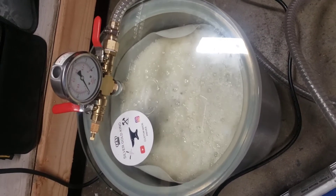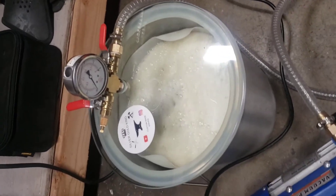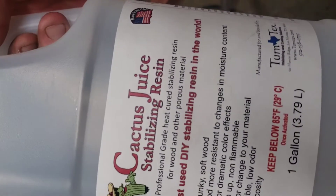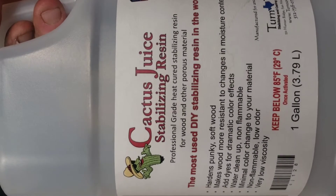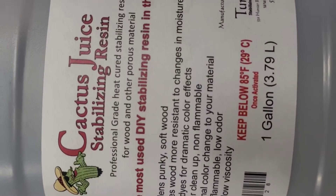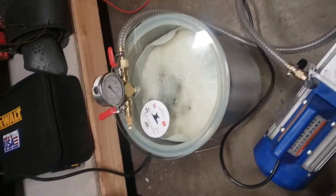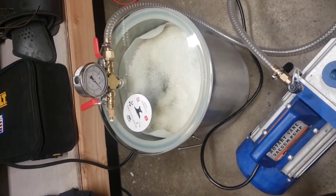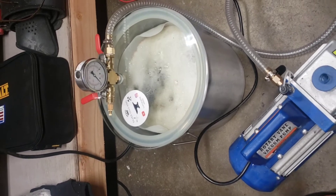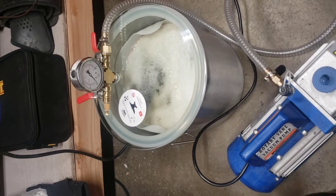What's good about that is it's like waterproof — it's like a resin that soaks into the wood. You've got to use this cactus juice right here. Pretty expensive stabilizing resin. And don't try to buy the cheap stuff at first either because it doesn't work — it ruins your wood. So just go with the cactus juice. Add the additive in it, and that's it. You've got to use it. It has a normal shelf life, but after you add the additive to it, it's done.